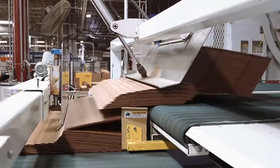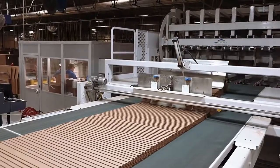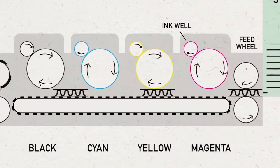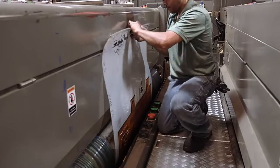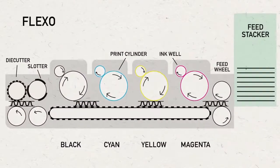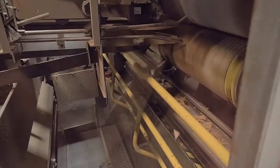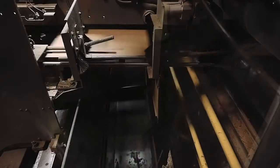The sheets are then shingled and loaded into a feed bed where feed rolls insert the sheet in the machine. Print plates are mounted on a cylinder and an ink system allows ink to be applied to the print plate, which transfers the ink to the board as it passes through the machine. This machine uses rotary die cuts as well, but it only produces one box per sheet, unlike the rotary-only cutter which can produce multiple boxes per sheet. The scrap is again recaptured and recycled for future roll stock.